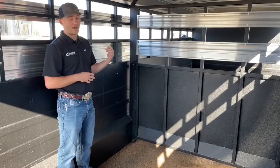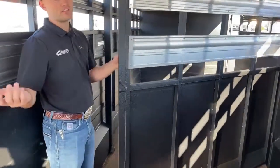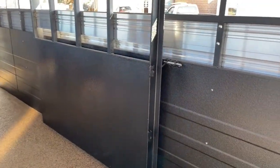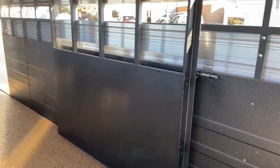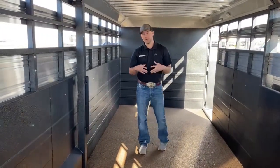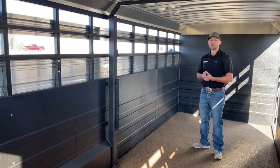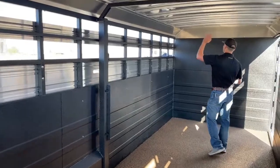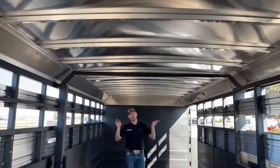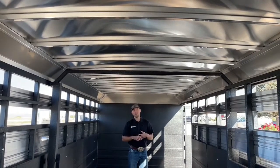On the outside, you hit that latch and the weight of the gate is going to fling it open, and then you'll be able to push it open and offload without being behind the gate with the animal. If you want to travel with this gate locked it's as simple as just releasing that latch. As you pan around this trailer there is vortex lining all over — anything that's kicking, scratching, or hooking horns on the supports is going to keep this trailer looking really clean for a long time. If it does go through the vortex and get into the frame, it's really easy to repair — grab a rattle can of rhino line, fix it yourself, or bring it to one of our shops and they can vortex line it again. This trailer roof is bowed — it has a slight bow to it — and for the same reason we drain the floor, moisture is bad for metal. So we keep the floor draining and the roof bowed so moisture runs off rather than sitting up there eating at the metal and eating away at your seals, adding to the longevity of this trailer.